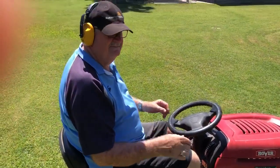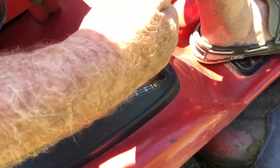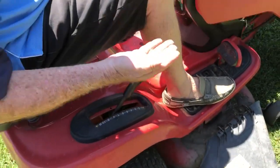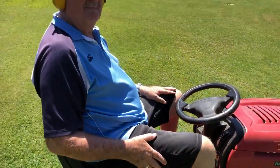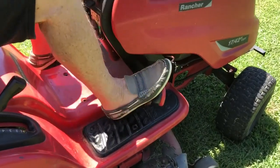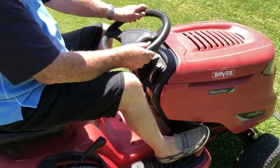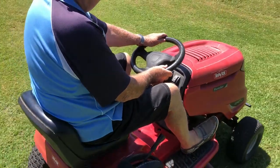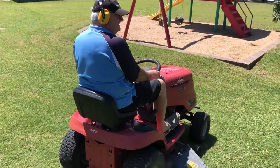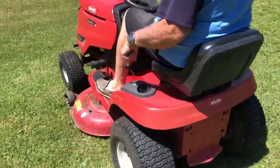Now at this point you can take your foot off the brake and not touch it again. This is the lever that adjusts the height of your deck for cutting height of your grass. I've got a mark there on that position — it's on about level six and that's about ideal for our grass level. If I press that lever foot, I'm going to move forward. I'm in neutral at the moment, but my left hand quickly flicks over and pushes it into forward gear and now I'm moving forward. Sometimes it's a little jerky when it starts because the belts grip.